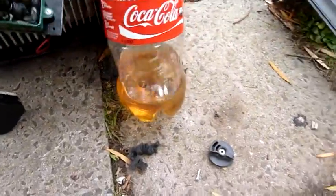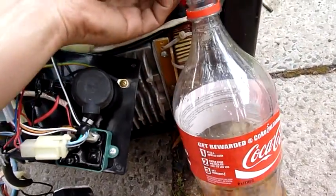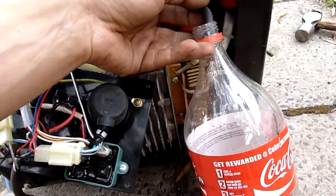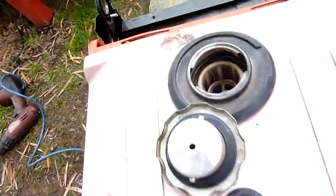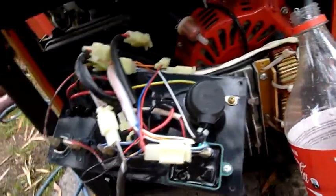Definitely bad fuel in it — not to mention the sediment. It's so bad it's blocked up the fuel valve and actually rusted it; it's had water and stuff get through. Just slowly draining that out. I think the hose itself is getting blocked — that's better. Unfortunately the tank's mostly full, so there's probably about 4 litres in there. I'll fill up bottles and take them for disposal, or use it for starting bonfires. Rat chewed foam — oh yeah, it's made a little mess down there under the inverter. Wouldn't surprise me if I find a dead one in here.